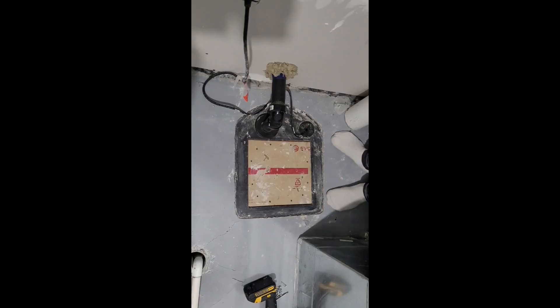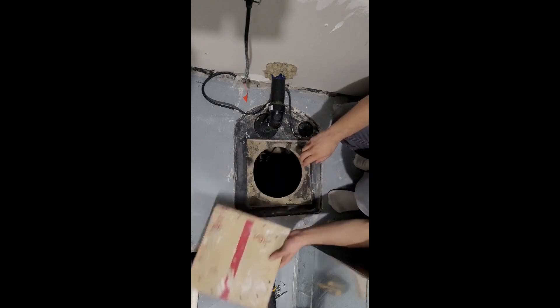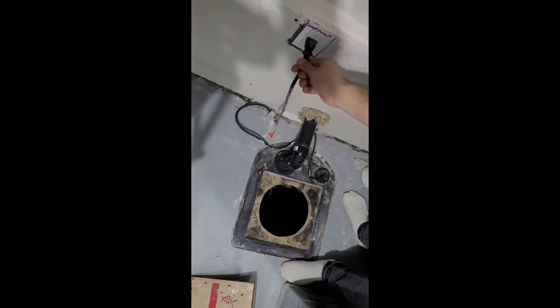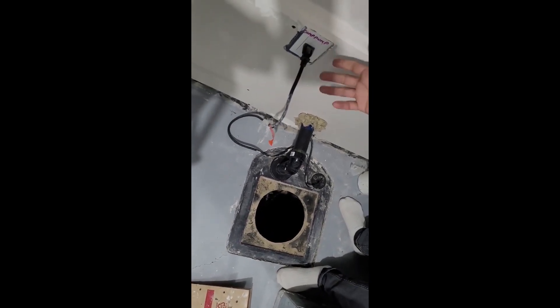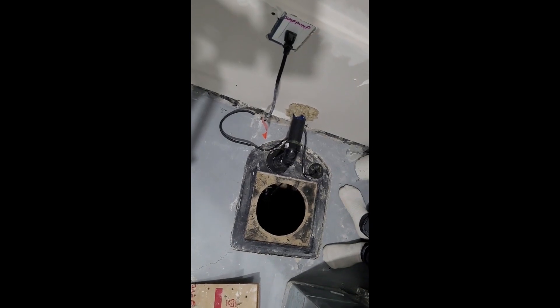You also need to inspect your sump pump before all the snow starts melting, because the sump pump drains all the foundation weeping tile water. There are two different kinds of sump pumps. Open the cover — if you see only one wire, that's the first type. The other model has two wires, and I'll talk about that as well.